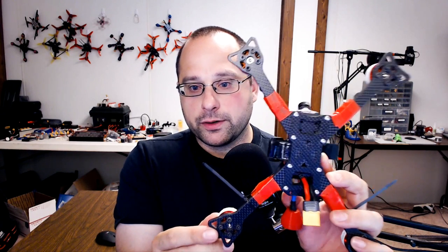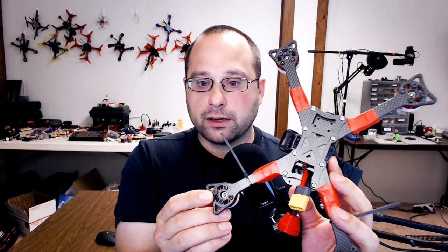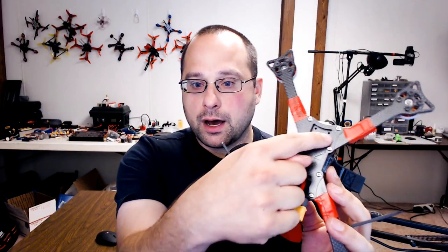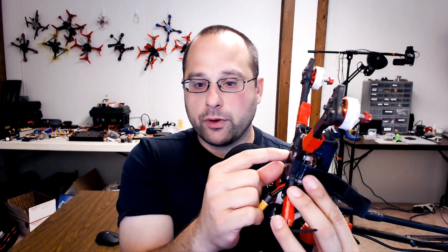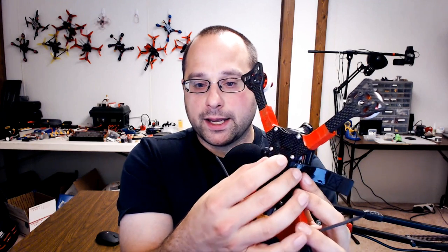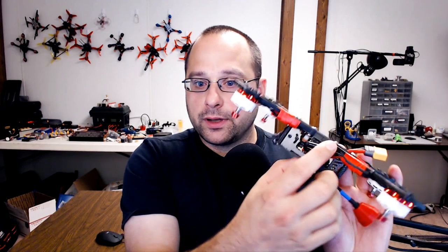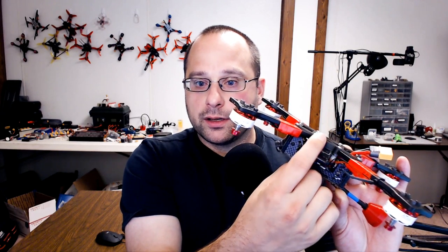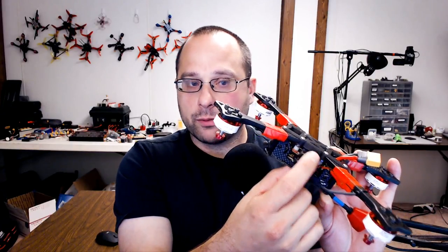The way that they come together on the bottom is also really smart. You can see here that the forearms come together and they fully enclose the bottom, so there's no hollowness. These are 1.5 millimeter plates on the bottom, and normally I would consider 1.5 millimeter to be too thin for a bottom plate. But they're doubled and they completely enclose the 5mm arm. So really what we've got here is 5mm plus 1.5 plus 1.5, like just a solid bottom plate.